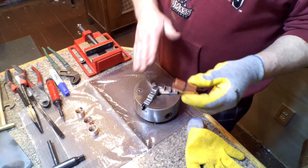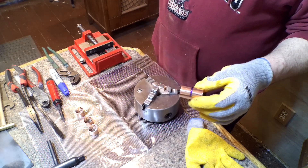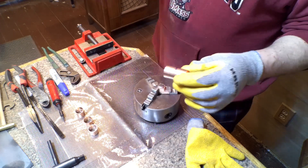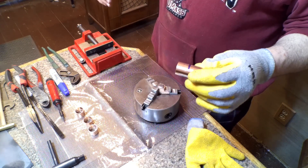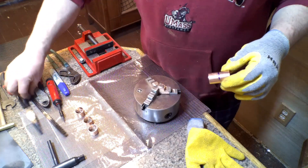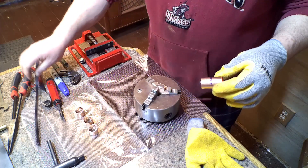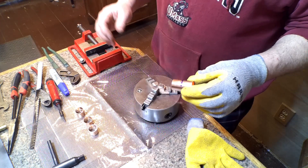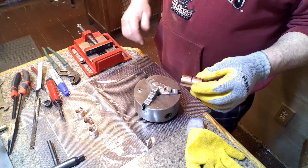I have stages here. I didn't want to record the cutting because I'm using a little 10-inch benchtop bandsaw and it's buried in the corner since I moved all these machines around — really loud and squealing. I did a couple cuts on the low vise with a good hacksaw blade. I put tape over it and used it by hand to get a better feel. When you clamp the jaw too much you crimp down the blade, so you have to leave it loose and use a very fine touch.